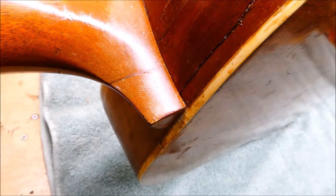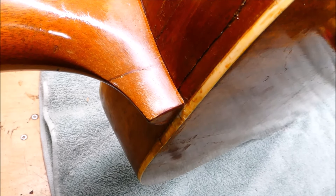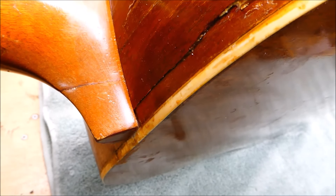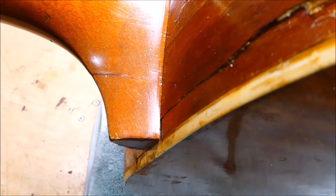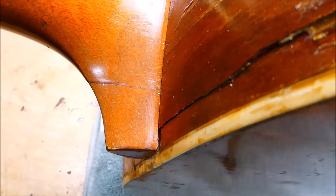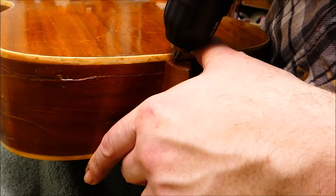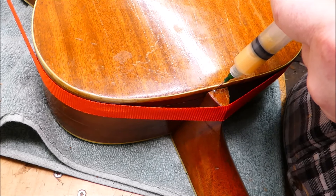This is for those people in the comments who tell me they love it when things go wrong in my videos. I was just stringing this back up with a fresh set of strings and I heard a poppy cracky sound — which is generally not what you want to hear — and the action got real high again. This previously glued crack has decided to come open and it's taking with it the end of the heel. I'm going to glue this thing together again and drill a small diameter access hole through the end of the heel to squirt glue down in there.